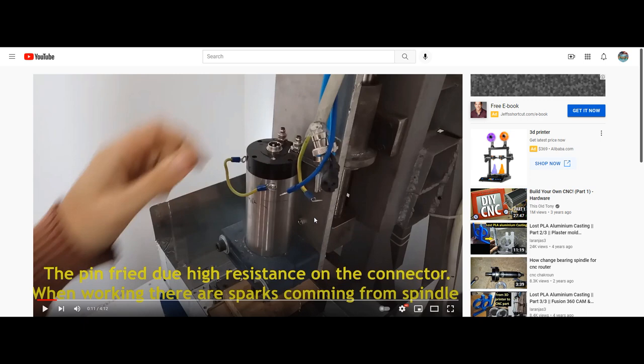You can also put one on your gantry, as long as there's enough lead on the gantry, meaning there's enough length in whatever ground terminal you're using, as far as the wire, or if you're using tin braided copper, which is optimal grounding material. You want to make sure it's long enough to naturally move with the actual gantry, so there's no pulling or tugging and everything is set. But again, the extra work will pay off not only in safety for yourself, of course, but also in mitigating EMI. So once again, I highly recommend against anything where you're drilling into the spindle body.